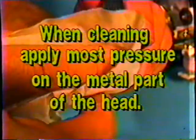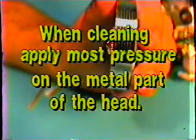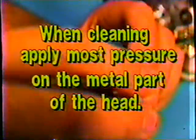As you get used to cleaning a machine, as you have the paper wrapped around your finger, you can actually feel it doesn't feel right. It drags and it's pulling, whereas on this side, it flows over very smoothly. Again, you have to be careful. If you go around a cylinder assembly, most of the weight is on the metal itself, and you just kind of glide over the head element. On this side, as you glide over it, you can feel it is not smooth. It's actually grabbing. It's like a burr on a piece of metal. You could actually feel it even through the paper.